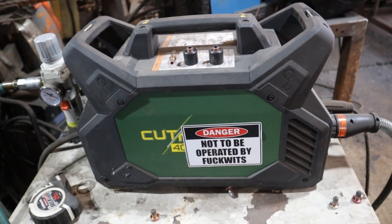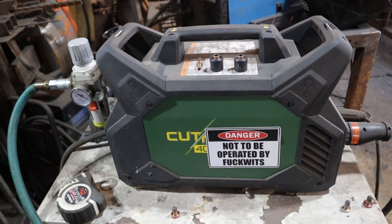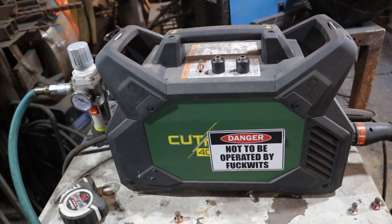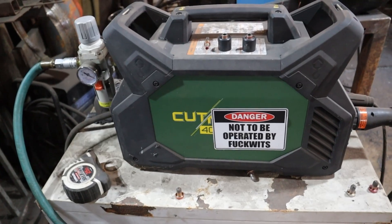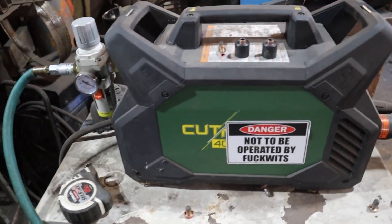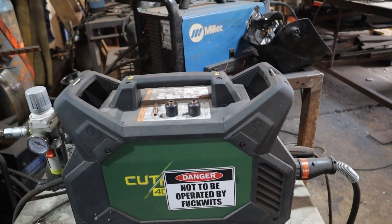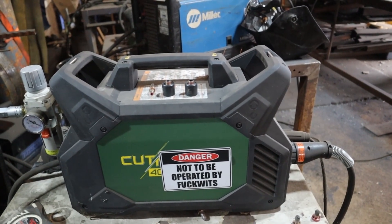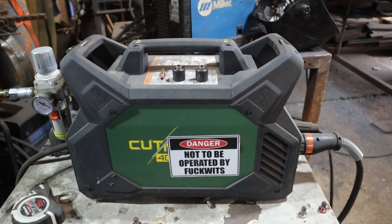This is after two years of kind of fighting this machine. I read the manual, crank the air up to 90 pounds, and my consumables now probably last four times as long as when it was running at 70 pounds. Four times. I don't even want to equate that to how much money that is. The lesson is: knowledge built up in the trades is valuable, but it's never too late to go to school — and sometimes going to school is just reading the manual.